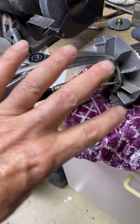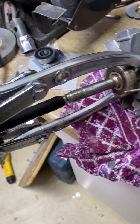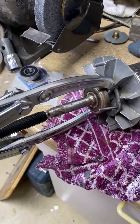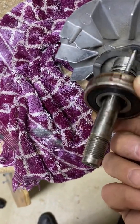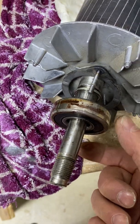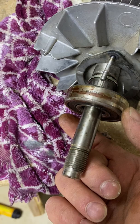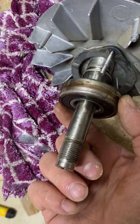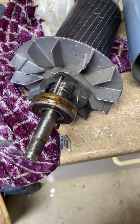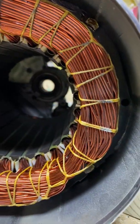Just tighten this up and with even pressure it should slide right off. I'll put a little WD-40 in there just to make it a little easier. The puller was able to pull this — it was just a press fit — to get this bearing off the shaft. It did take a significant amount of torque on the puller to get it, but it smoothly came off. Now we have to get to that top bearing, which is in the upper lid.